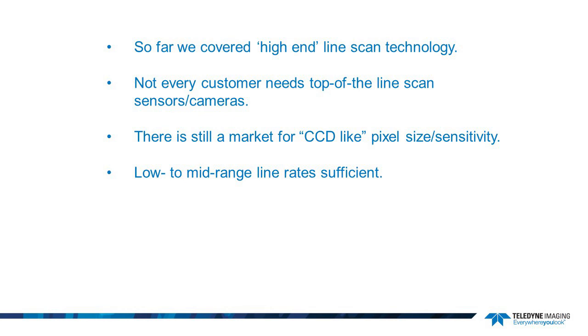So far, there was very high-end, high resolution, top of the line, very high line rate, but that's mainly in markets in Asia, flat panel inspection, electronics inspection, but not every customer needs that. I mentioned recycling and food sorting, and this is standard to low resolution sensors and quite moderate line rates, which could easily be going through Base Camera Link, or even gigabit Ethernet, standard GigE cameras.